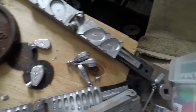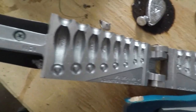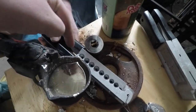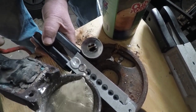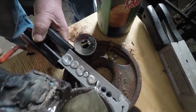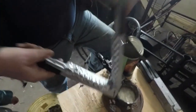So in just a couple minutes here, we've already made three nice fives — three or four. Once you get in a groove, you can sit here for just a couple hours and make a couple hundred sinkers. We're going to try to do one more — just these little guys right here. I use these while I'm white bass fishing especially. We're going to start here on the end with an ounce and a half and it moves down just a quarter ounce down to about an eighth. These are a lot harder to do — you have to make sure to have a very steady stream. You don't want to do it too fast. Keep in mind, no matter how many times you do this, you're going to make a bad one. This is metal — it's not an exact science, it's a technique. It takes a lot of practice, and until you get in that groove you're not going to have a bunch of perfect ones right off the bat.